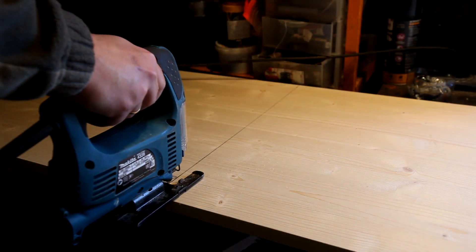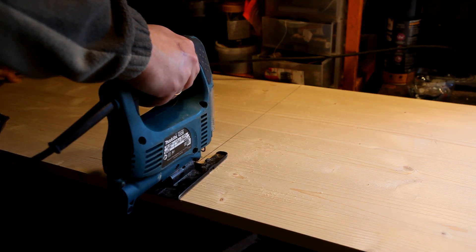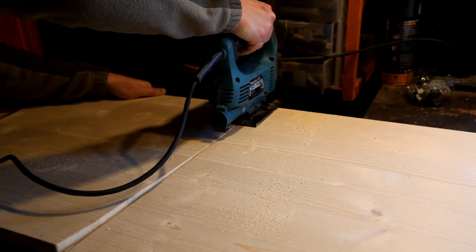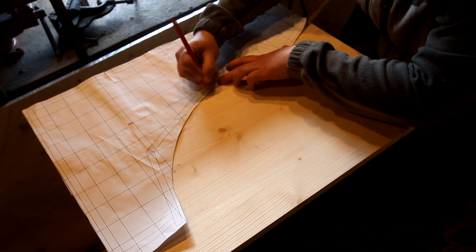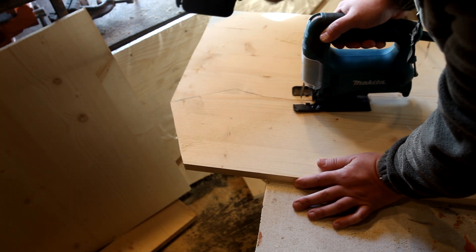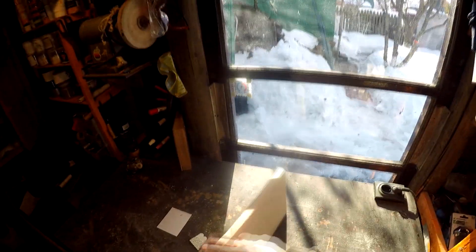First, we unpack the panels, remove the film, carefully measure with a tape measure, and cut. I'm cutting with a jigsaw, though a circular saw is better, and a table saw is even better. But since I don't have one yet, I try to make a clean cut and use a fine blade for straight cuts. It takes longer to cut this way, but there's less need to file the edges afterward. When all the blanks are cut, you can take the template and mark the curve of the side surfaces. And this is where the jigsaw is your best friend. Use the finest-tooth blade for curved cuts and carefully, without rushing, cut along the contour. Then take a file or sandpaper and sand the edges starting from 40–80 grit up to 1000–2000 grit. The surface should be smooth.